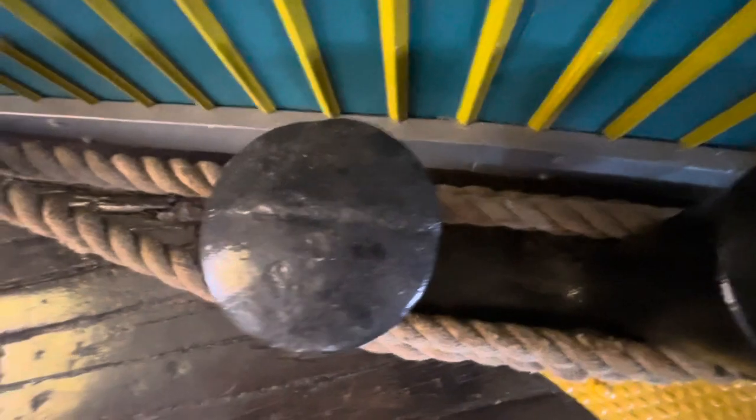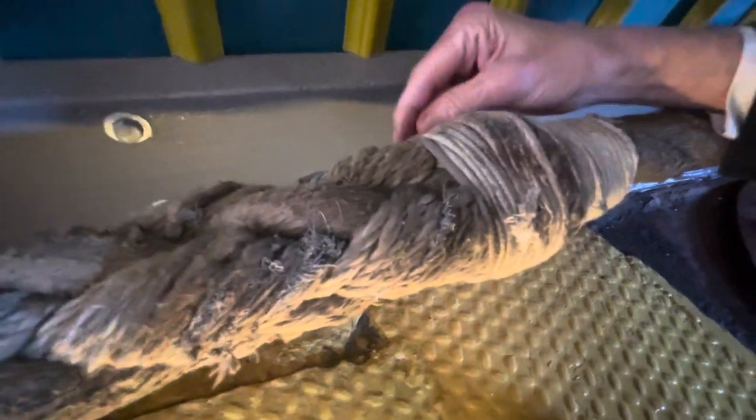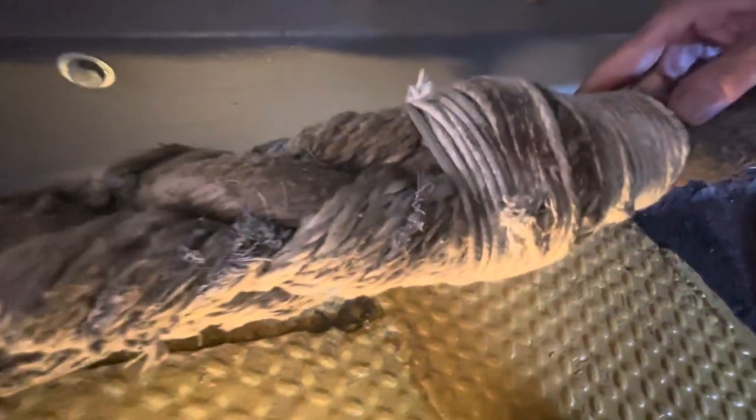Now this one's kind of been through a war, so it's not as pretty. But see this big eye? It's called an eye. I've been calling it a loop for you. And here's another eye. An eye is a hole that you've made by looping the line back. Where the eye finished its weaving back into itself, it was all fraying really badly — just shags hanging down. And so I did whipping, and it was all tight together. It's hard and tight and holding this from fraying.